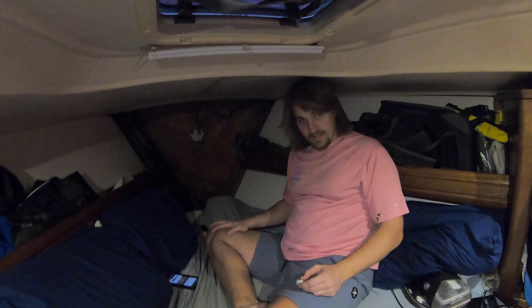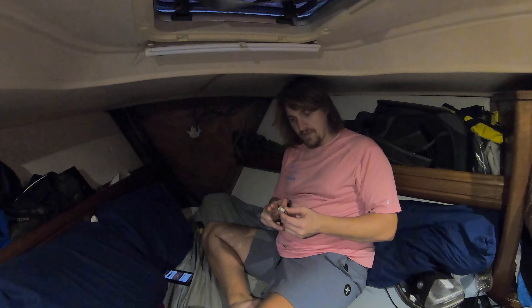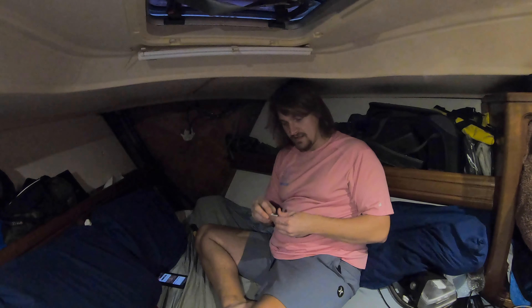So we've been having issues with the nav lights and trying to diagnose for a couple days now. The issue was it was just really dim and we thought it was just the light bulb, so we got a brand new LED. What we did is we went up top on the deck and spliced the wire that ran to the nav lights — it was super dim. So then we came back here, found which one it was, spliced that, and this is the result.